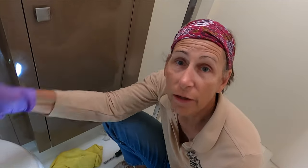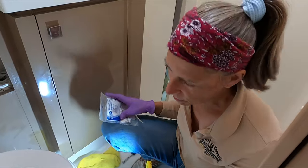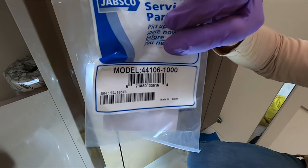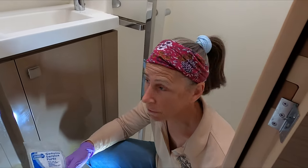I'm going to call this a success. Now, the other toilet on the other side I think is doing the same thing, so we'll go check that one out. We bought two of those joker valves, so we'll go ahead and replace the joker valve on that one too — might as well just replace it. It really wasn't that bad; I thought it was going to be absolutely crazy, but it wasn't all that bad to change it out. For this particular Jabsco potty, the part number you need is 44106-1000. Jabsco makes a bunch of these toilets, but I was able to find our exact model. We got the last two, otherwise we would have grabbed a couple more for ship stores. We'll order a few more for spares. It fit perfectly — exactly the right one.